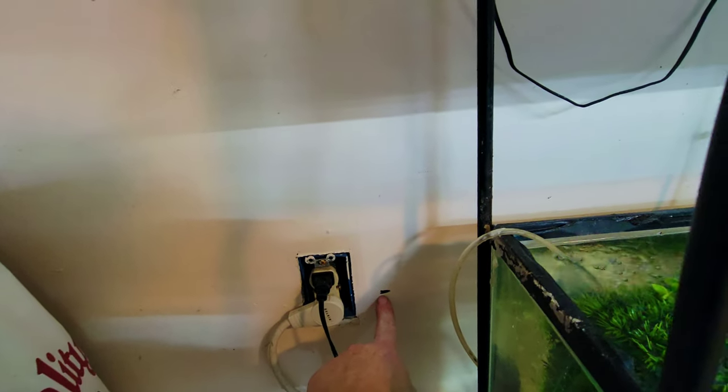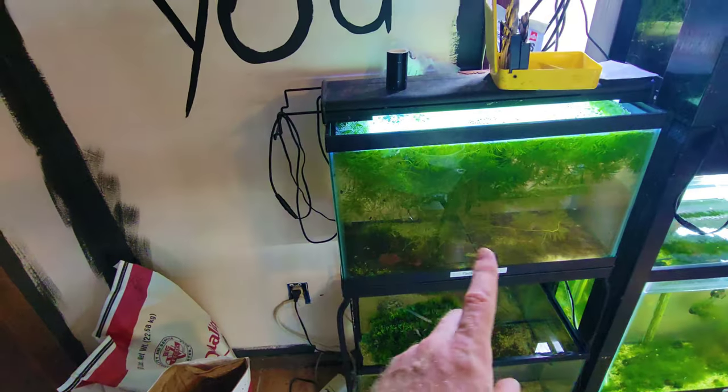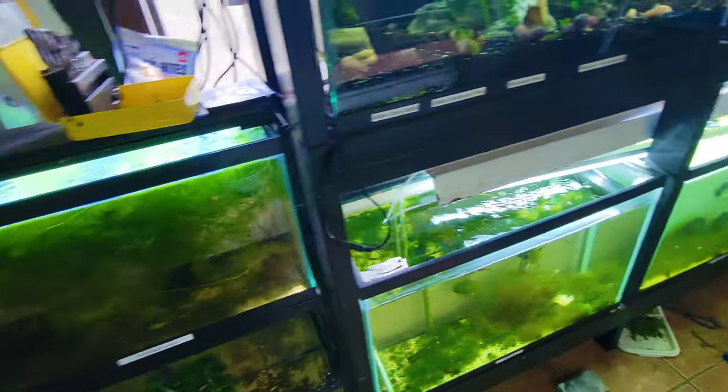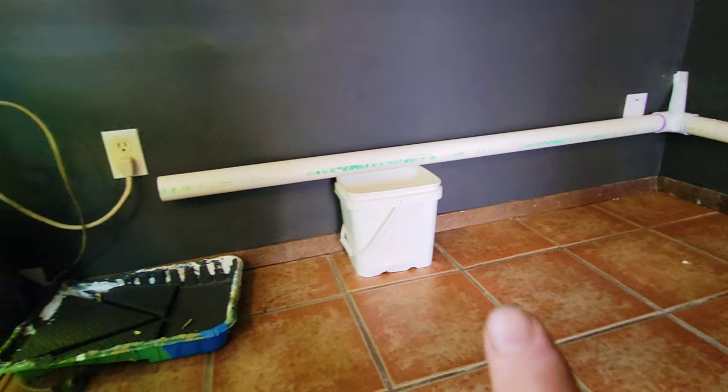The bottom of the drain pipe is going to be right here on this wall to have enough fall. But I'm going to kill the drain right here. It won't need to go any further because I'm going to have longer 4-foot tanks on this wall, and I'll put the drains on this end. So the drain pipe won't necessarily need to go past that outlet. I got really lucky on how the height of the drain pipe needed to be versus the height of the outlets. And this one's actually higher than it needs to be.